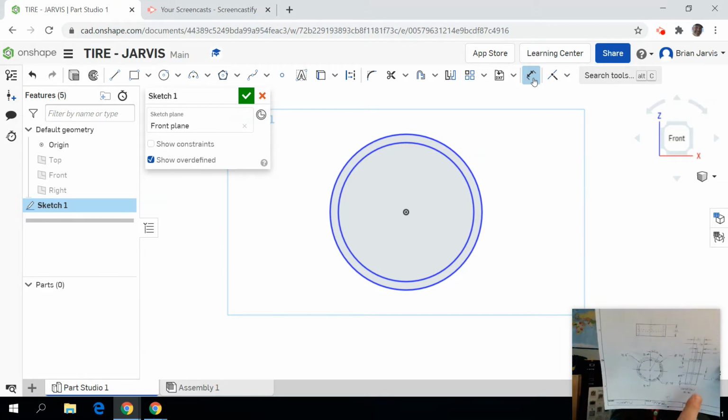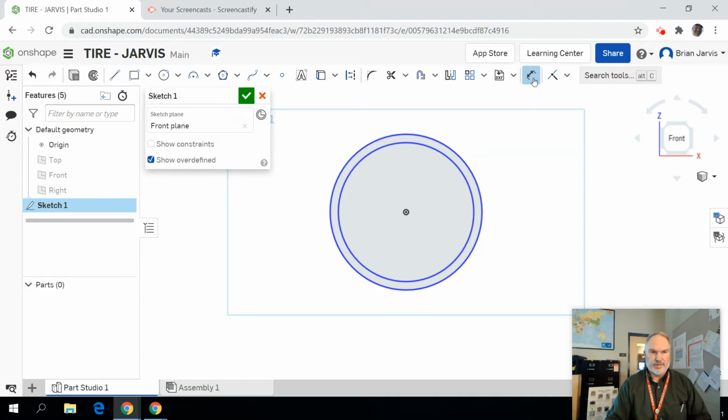I did the sketch, the front view here, right? And then up above it is a top view. But the top view, see all the hidden lines? Because everything's hidden, I did a section view over here, basically as if I cut this section right out of here, and I can show you what it looks like right there. And I can dimension all those little pieces right there too. So we're going to talk about section views very soon. But for now, I'll just go ahead and build one. We can always add to our sketches later.